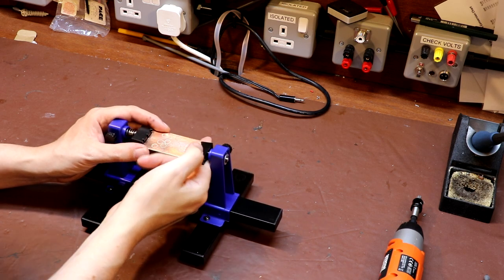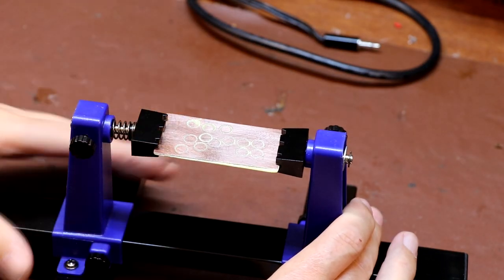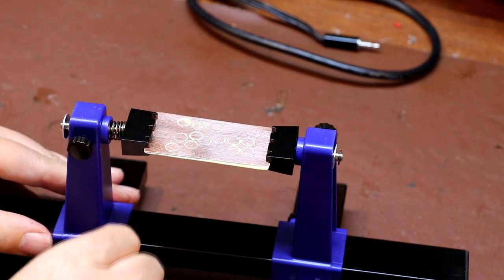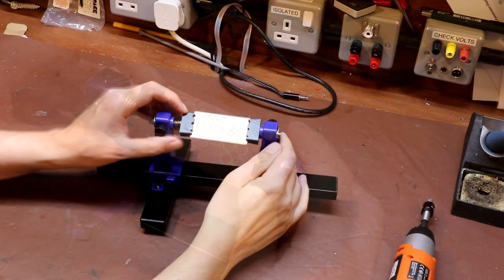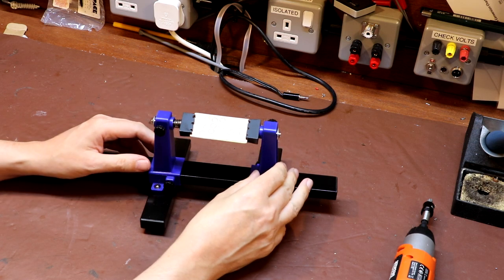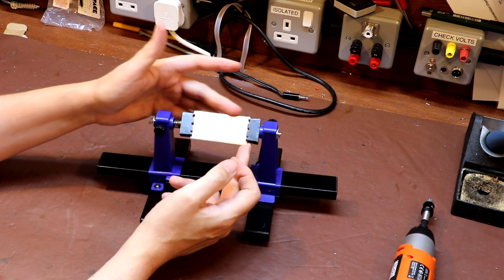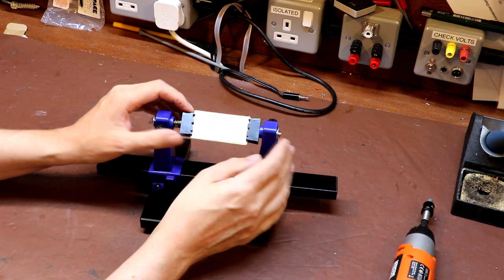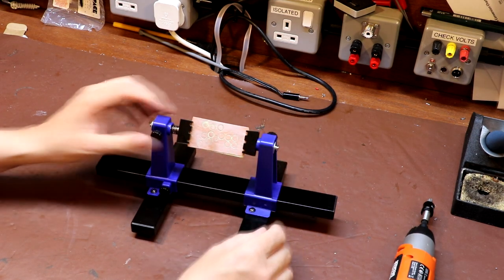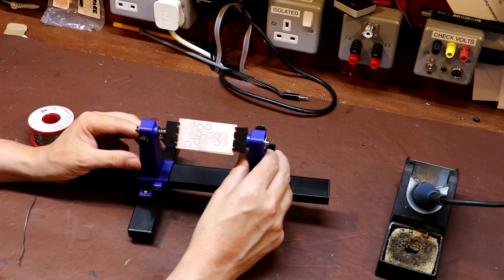The ends of these clips might actually be metal, so if you're working near a soldering iron it doesn't matter. This end of the stand is actually spring-loaded — you tighten that up and it compresses the spring, which grabs everything more tightly. It does seem to grab our board really quite firmly; there's a little bit of wiggle but I don't think that really matters. The big advantage is we've all been there trying to solder with a circuit board on a flat table — you put the soldering iron against it and it starts to push the board across, and you're chasing it. This grabs everything much more positively and you can present the board at a more ergonomic angle. First impressions aren't bad.